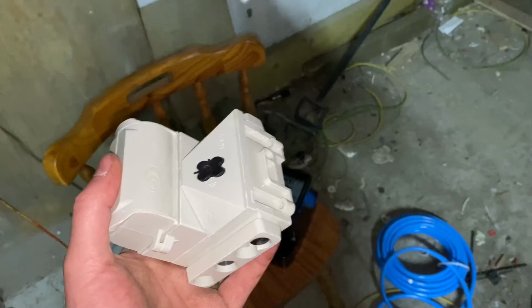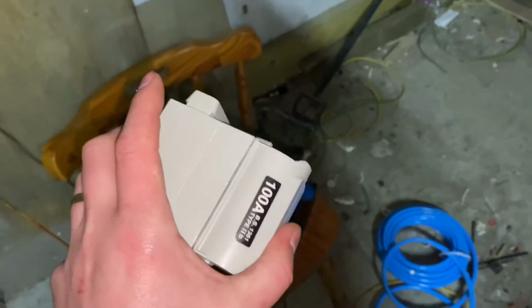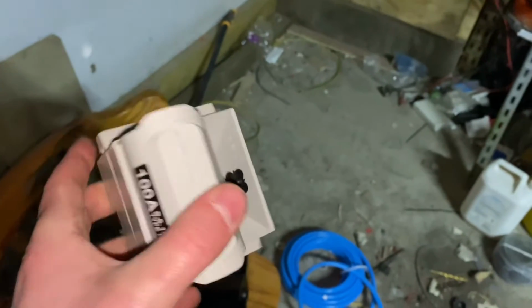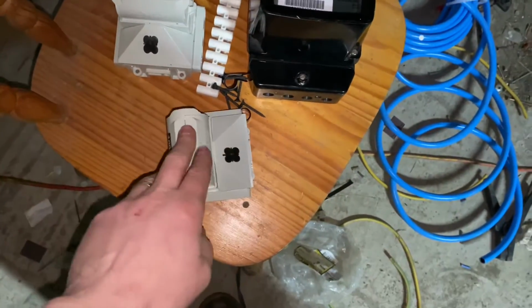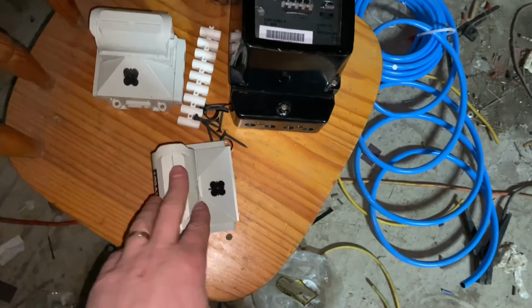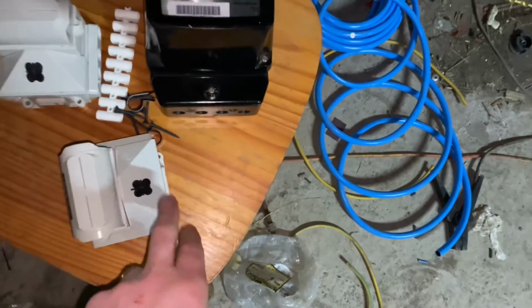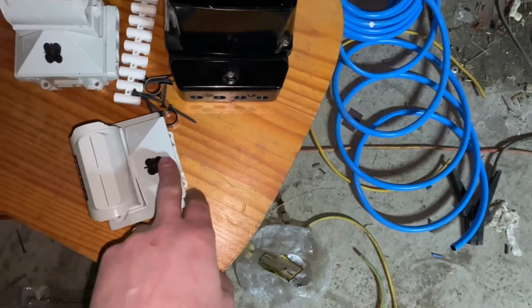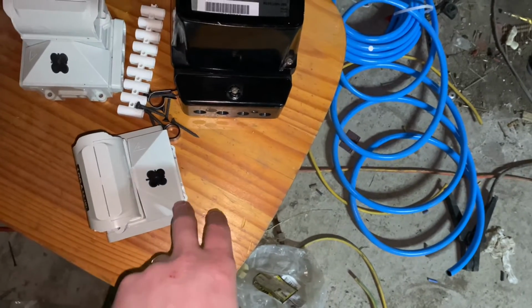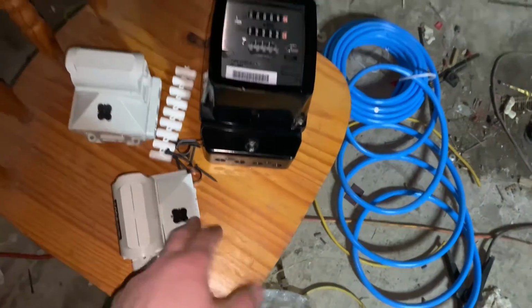Another comment, somebody thought we'd got grid electric because I use these cutouts in each building. People have said, you don't need them, why are you using them? Well, if you look in your normal domestic dwelling, you've got a primary form of protection, a 100 amp fuse. You can actually put a 60 or an 80 amp fuse in there for a smaller system. And then you've got a 6-way earth block there to put your earth rod into, your earth coming from your inverter, your earth from the structural steel, your earth from the water bonding.